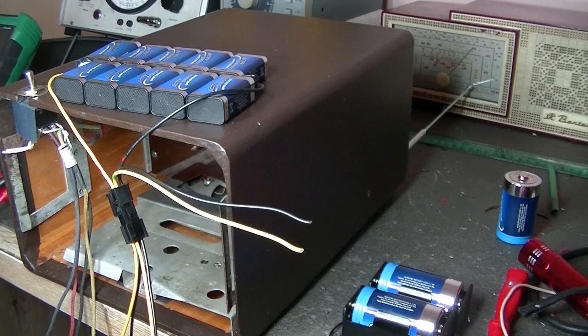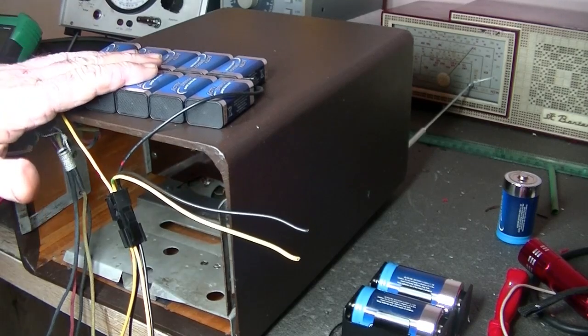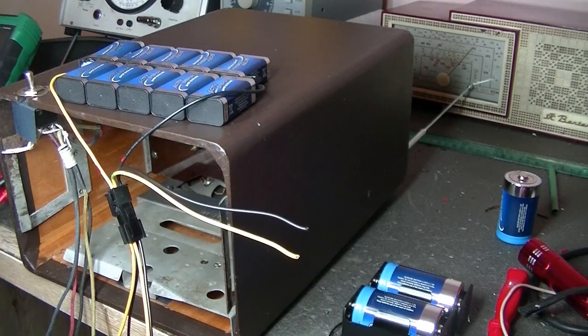I'm lost. If you guys have got any ideas, please let me know. I'm not having any luck with this at all. You know, 1.5 doesn't work off the power supply, but B+ does. B+ from batteries doesn't work, but the 1.5 does. So, great. But anyway, we'll sort it out eventually. Next video, I'm going to go back to this power supply and suss out what's going wrong with the 1.5 volts. Got to get that to work.